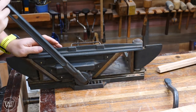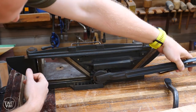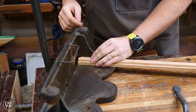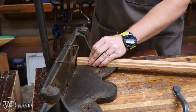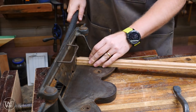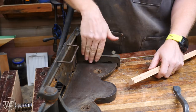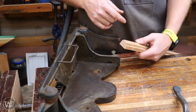So let me show you this. Here's the mechanism on the back — it's basically just this big gear that rides in there, a really simple system, and then two big blades. So what exactly is this thing good for? Well, you can put your stick in here, line it up to the edge, just go a little bit over. You don't want to take off too much — you can probably take off a sixteenth if you really push it. But then it just shears off the end, and you have a perfect 90-degree cut that is extremely smooth, a glass finish. With the fence set all the way up against the blade, you're not going to have any tear-out, just absolutely perfectly glass smooth.